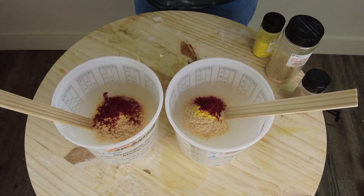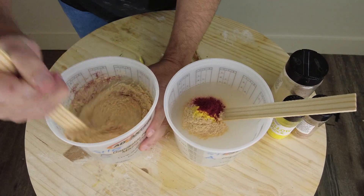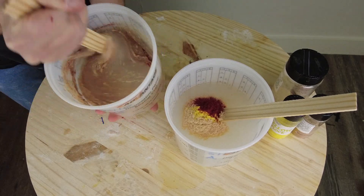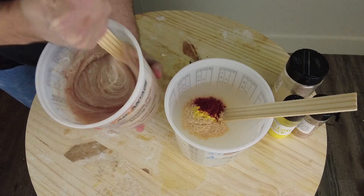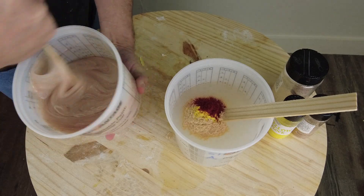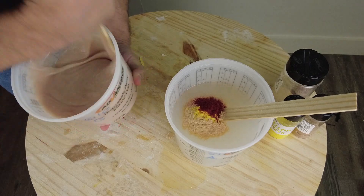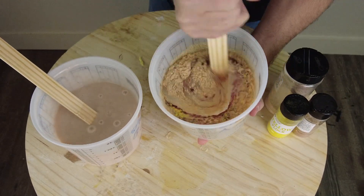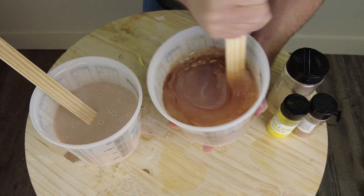The reason I'm mixing this fairly fair and light is you always want to match the lightest flesh tone in the color scheme. With silicone, when you're painting with translucent paints over a translucent material, to preserve that realism you want to be moving darker, not lighter. If you start with something too dark and have to lighten it, you'll have to add opaque colors, and that will really kill the translucency and ultimately the realism.